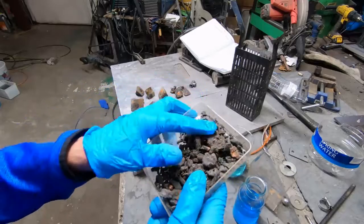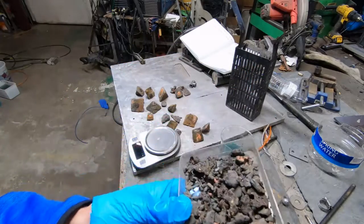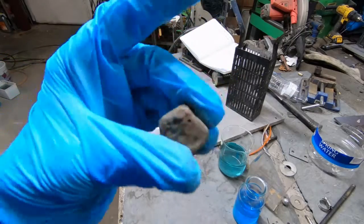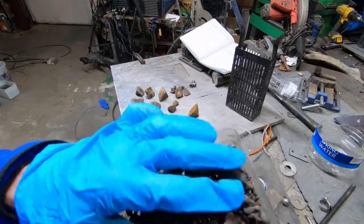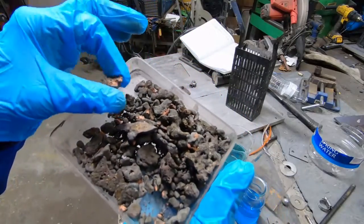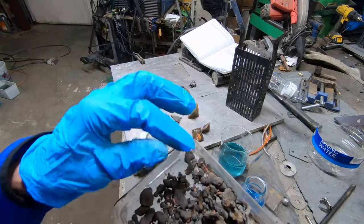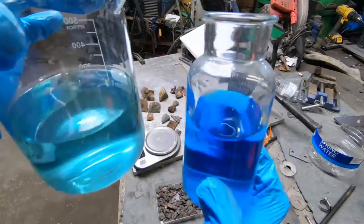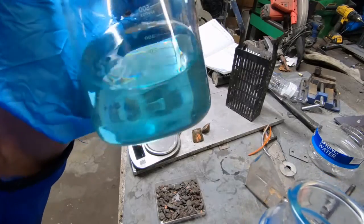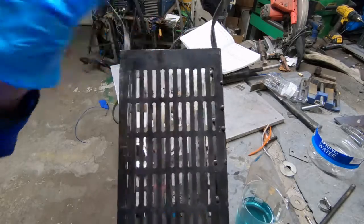I also discovered that these very small pieces is not a very good idea unless you have extremely high flow passing through them. We're probably going to want to stick with items around this size. These smaller items become kind of clumped up — they do appear to continue dissolving, but I've seen so much anode sludge in there. For 60 hours without doing anything to our electrolyte, this is what we ended up with, and at that point we began to liberate some gas. That is also when the anode basket will start to eat itself, but in this particular case that did not happen.